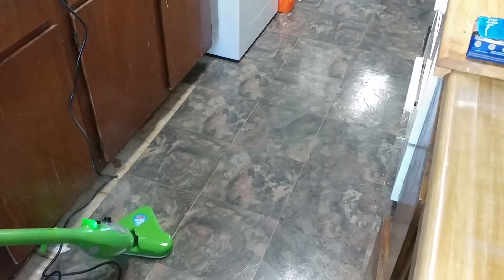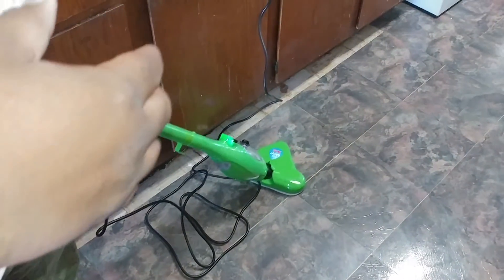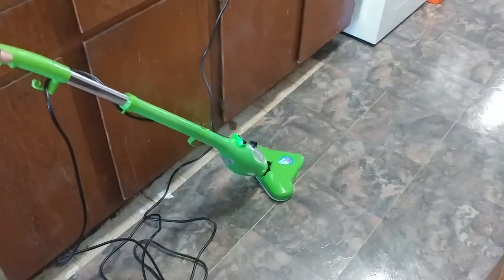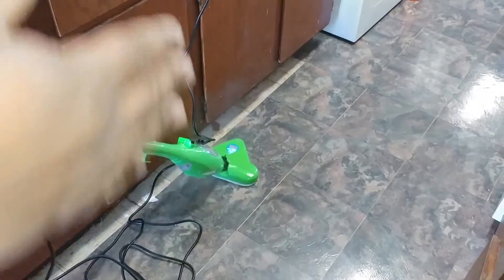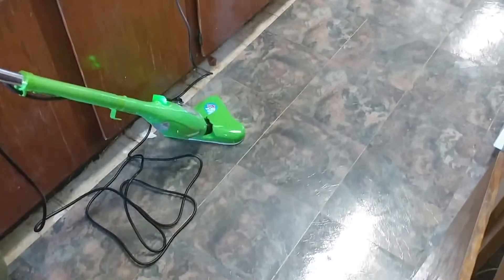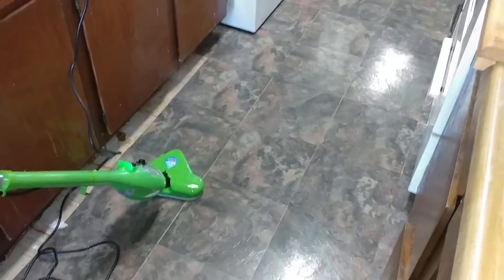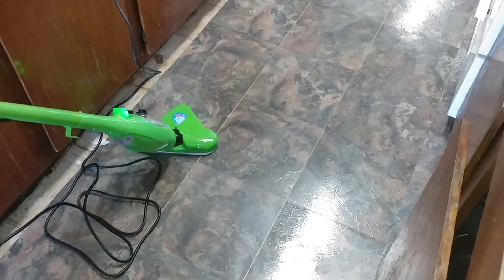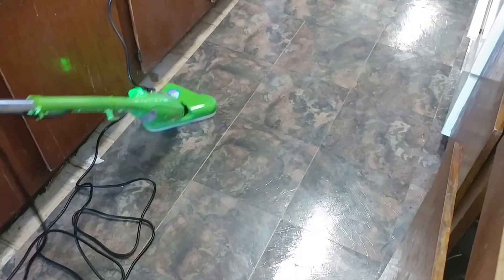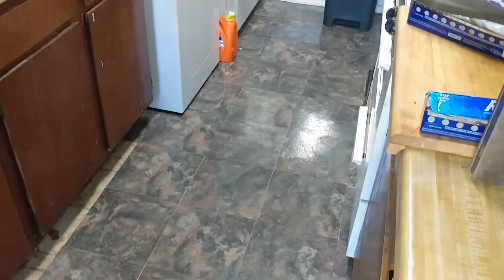Some of the tiles are sliding because we didn't get to finish the other part, so it wasn't tight. I'm just heating it back up so it could be loose again, then I slide it back into place so it's flush up against the next tile. I'm heating it, letting it stay on there for about ten seconds so the glue under it is nice and warm and loose, then just kick it back in.